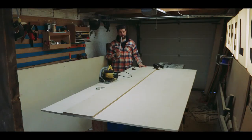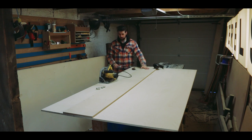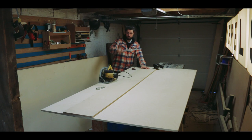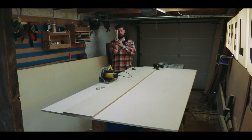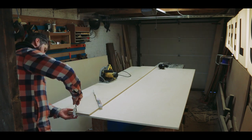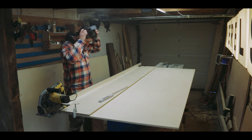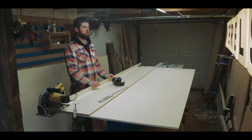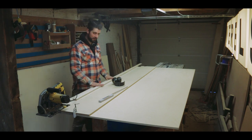For this next part I hope I got a tiny bit smarter. My track saw track is way too short for a full piece of plywood, so I'm going to use another piece from the same factory to use as a straight edge to guide my saw around. I have to cut a few thin strips — five centimeters — two five-centimeter strips to become the upright against which my bed frame is going to rest. I just have to take the width of my saw which is 16.5 plus 5, so 21.5 centimeters. Great success — and I think I need to build some dust collection in this workshop.